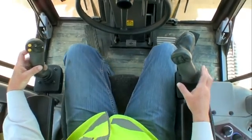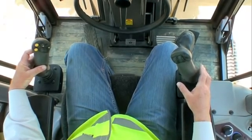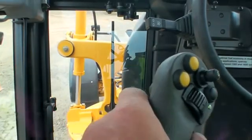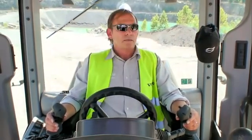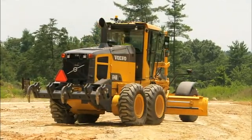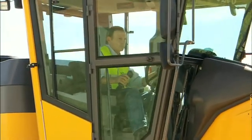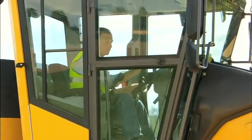Optionally available are Volvo's joystick controls that retain the function of a steering wheel. Volvo has placed all of the blade control functions as well as the transmission operation and steering into two joysticks. Other features include an articulation stop at center, and customizable operator profiles allow the adjustment of hydraulic response to meet the operator's skills, habits, and application requirements for maximum productivity and convenience.